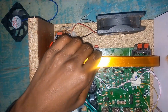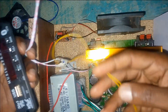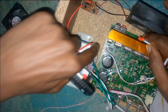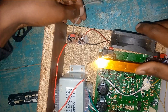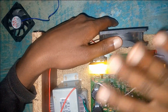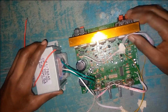This 12-volt source I'm going to use to power this Bluetooth device. These two yellow wires I'll explain about later — we'll tap 12 volts from this point and use it for our Bluetooth device. This fan I said will be using a 5-volt charger — 5 volts is enough. These blades are so big they can blow air quietly and smoothly without causing vibration while still doing their cooling job. So that's number one.